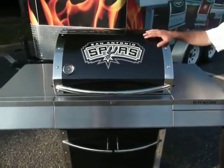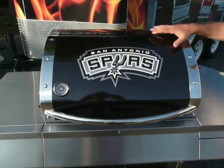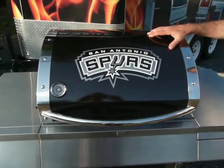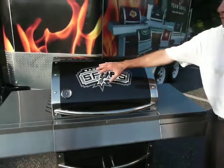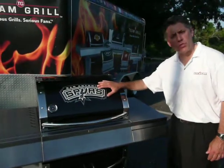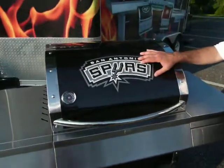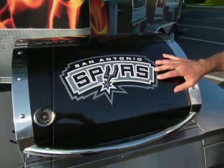It's actually a triple fire process. Team Grill has perfected this by putting a ground coat down, then a cover coat — the color. In this case black, but it could be blue or red, green, whatever your favorite team is. And then on the third firing, we actually fuse in the decoration. The decoration is also using high temperature porcelain inks. In the case of the San Antonio Spurs here, it's got a beautiful metallic look to it as well.